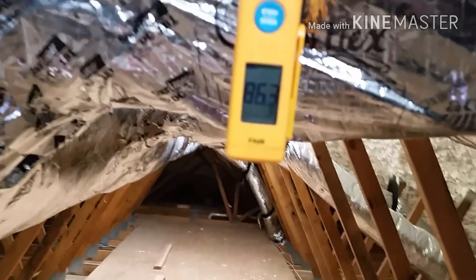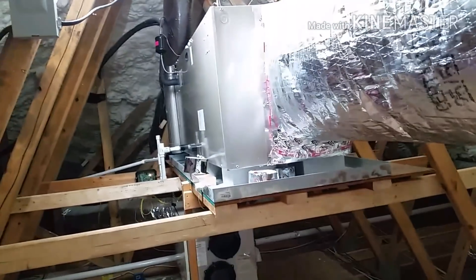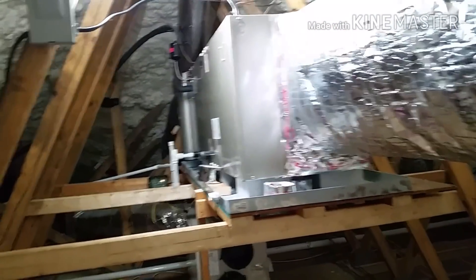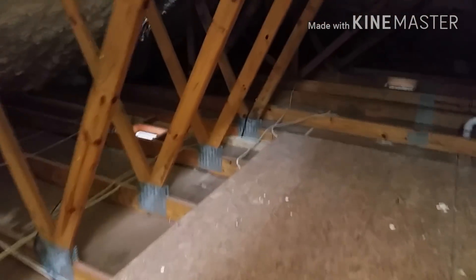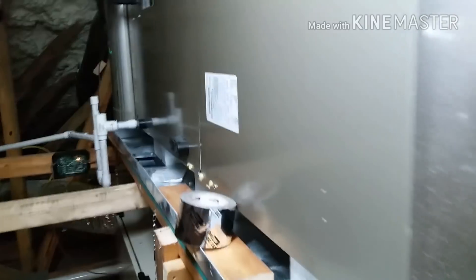Everything's not quite finished yet, but being so cold outside — supposed to be 15 tonight — I wanted to get everything running and get it warmed up because there's still painting and things like that in here. We're still going up, almost at a 30 degree temperature rise, no electric heater in that air handler, no heating package. Returns are cut in all the rooms, spray foam everywhere. It's got averaging sensors everywhere, not just using the Evolution user interface on the wall — there are sensors in every room.